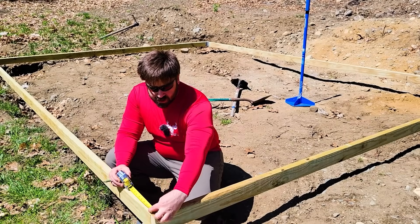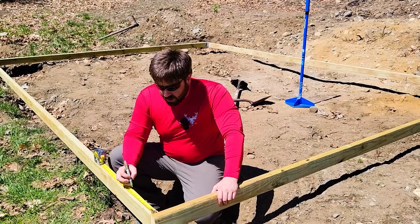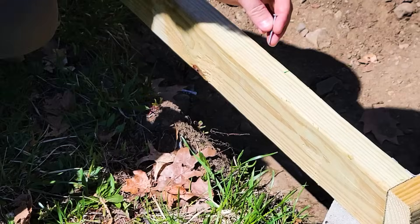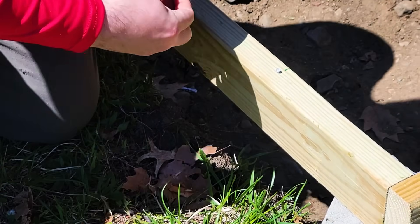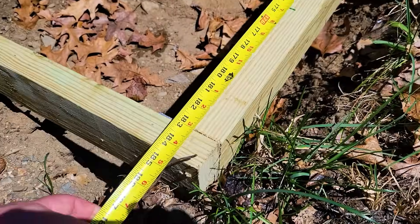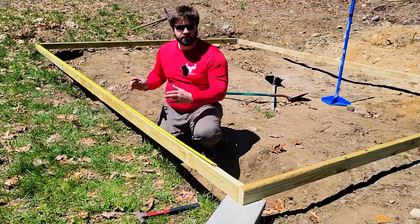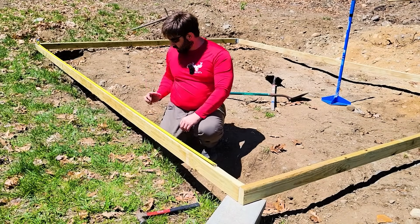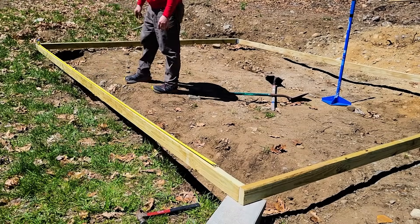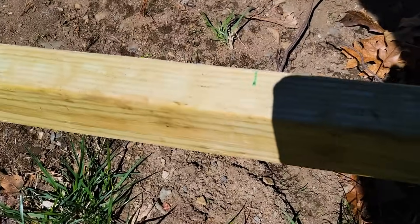I'm going to put this on the edge of the 16-foot run. My forms for my foundation are 18 and a half inches, so the middle of that is going to be nine and a quarter. That's the first mark, and then I'm going to come in nine and a quarter on the other side. We've got our tape measure hooked on there - that takes us to 173 and a half. So if we divide this length into three equal sections, that's about 58 inches each. So we're going to come in 58 inches and make a mark, and at 116 we'll make another mark. So now we have our evenly spaced footer locations.